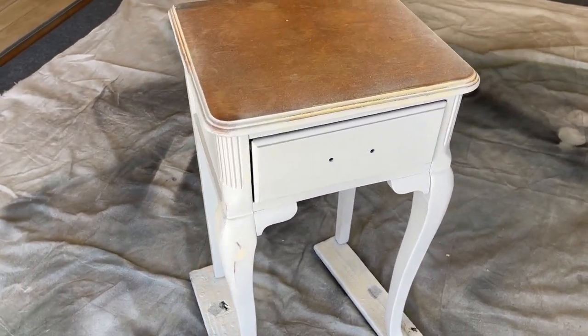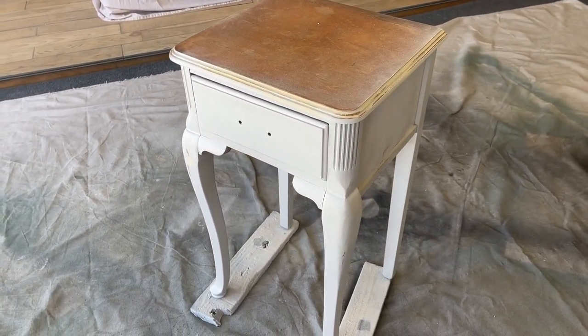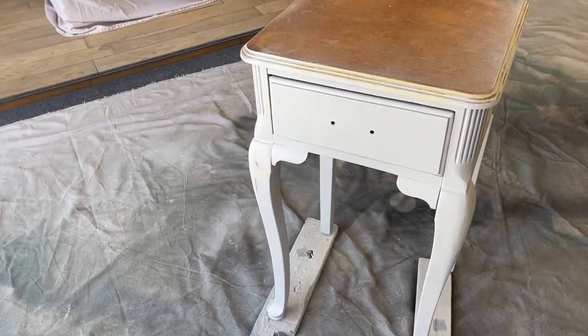Here today in Northern California we're about 77 degrees — it's actually perfect painting weather and we don't have very much humidity, so it's pretty dry. Our first coat is looking good. The label says you're going to want to use a degreaser, a TSP-type cleaner, clean and rinse well, and sand and scrape any loose or peeling paint off. I get asked all the time: can I paint over something already painted? Yes, you can, but you want to make sure you get most of that old painted finish off. Don't paint over peeling paint because your final finish is only going to be as good as what you start with.